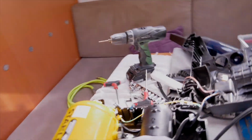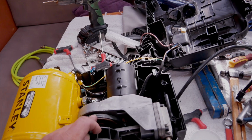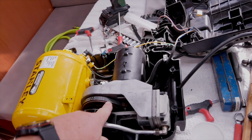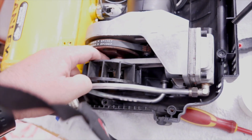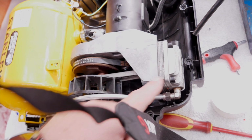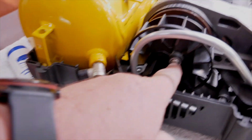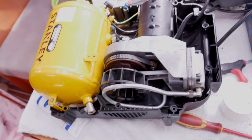Got the compressor out. This belt was a nightmare to get on, an absolute nightmare. I nearly gave up. But eventually we managed to seat it into the V's and then stretch it over the motor. But to get it past the crankshaft, I had to take the crankshaft out or off at the big end, slide the piston out, and to do that I had to take the head off and the fan off and this bolt off of here, and then all of the hoses out and replace the whole lot back in again to rebuild it. What a nightmare.